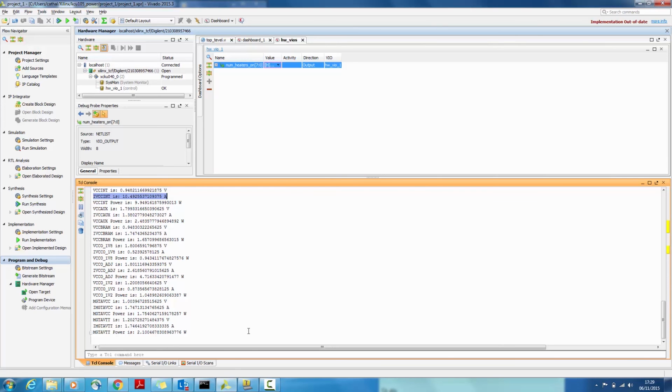So now we've demonstrated two methods for quickly and easily measuring the power being consumed by an UltraScale device on an evaluation kit: by using the Maxim power supply features and tools, and by leveraging the SYSMON features for more accurate power readings. Both solutions can be implemented in the end system, but the SYSMON method can be implemented regardless of the power supply vendor. Thanks for watching.